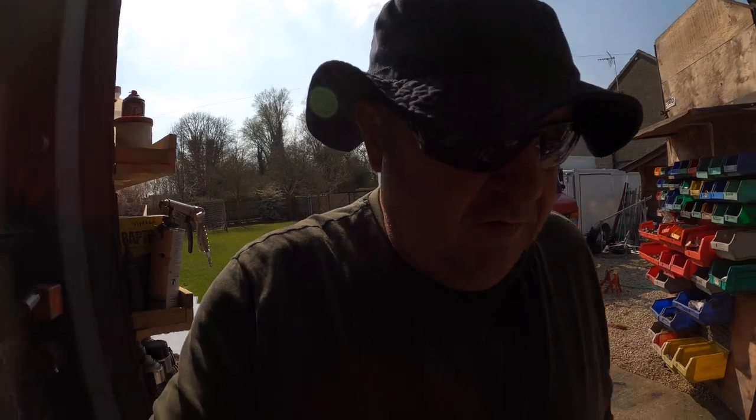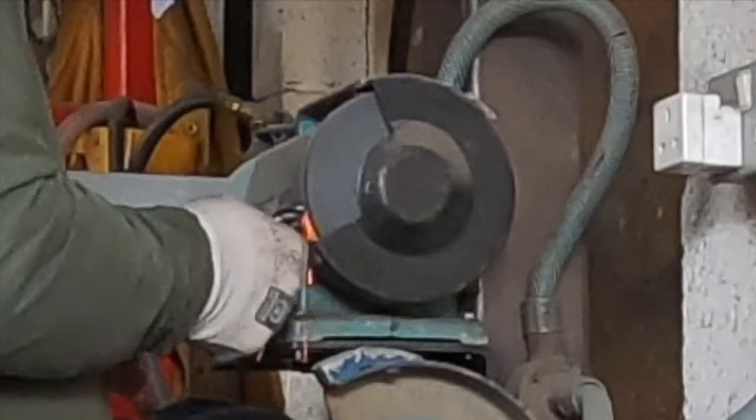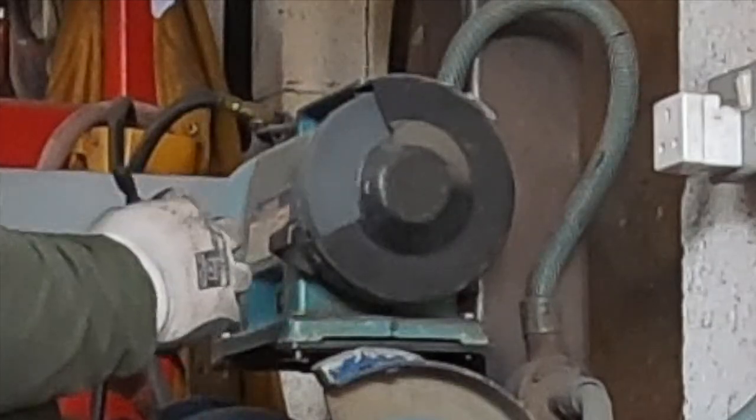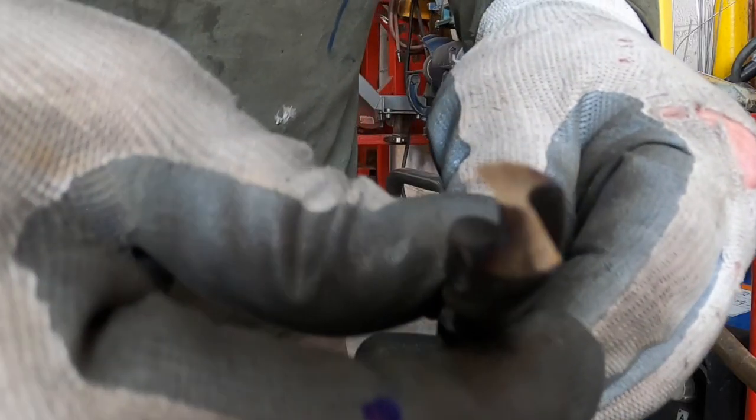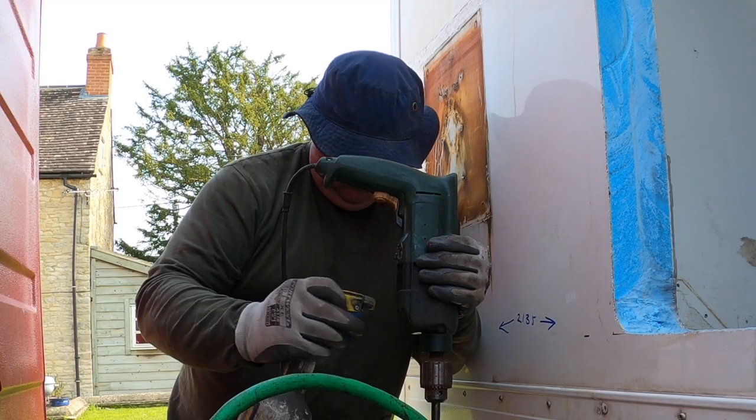My drill didn't have enough clearance on it and it kept binding up in the hole, that's why I snapped it. Need to buy some new drills, I think. That should do the trick.